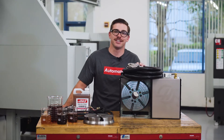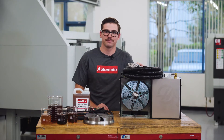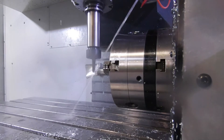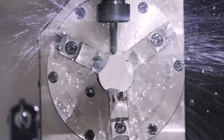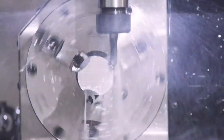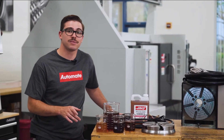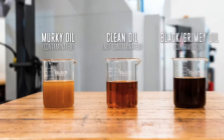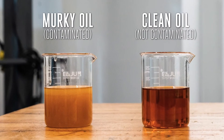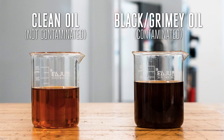I just grabbed this HRT 210 straight from the line and checking the oil, it is filled up and ready for production. Under normal conditions it should be good to run for another two years before needing an oil change. However, there are some instances where the oil change may be needed before that time. If the oil in the sight glass is murky or significantly lower than it should be, this is a good indication that there is a leak somewhere on your rotary. This could be allowing oil to escape or coolant to enter the enclosure. Additionally, if the oil has turned black and is grimy, this is also a good indication that the oil needs to be replaced.